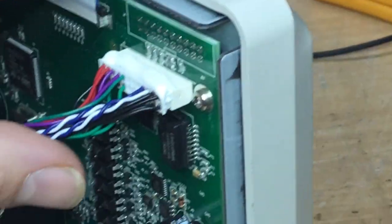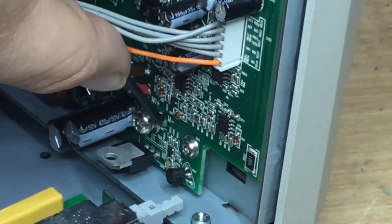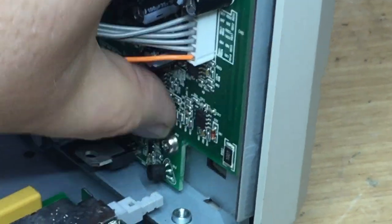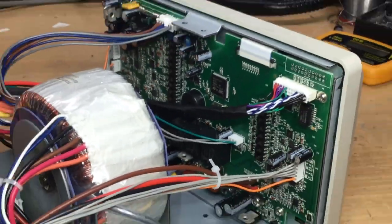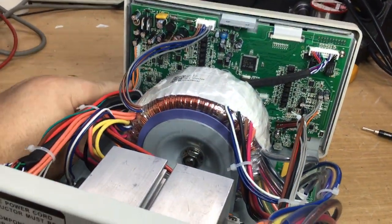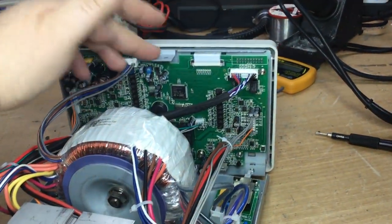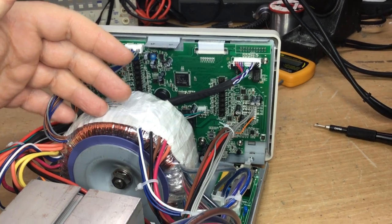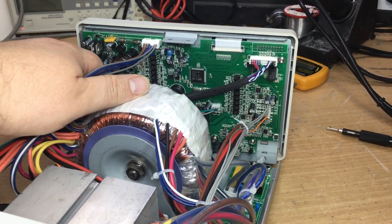And once that's done, then we'd remove all the screws around the outside edge, and obviously for the terminals, which are these screws here, which go through to these front terminals. And that would then allow, ultimately, once we've removed all those, because we've got them in all the corners, some more here and further down at the bottom there, once they're all out, then the board will come away from the front panel, and that then will expose the connections for the components underneath, hopefully.